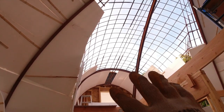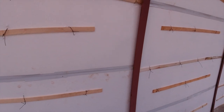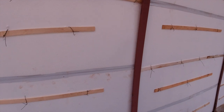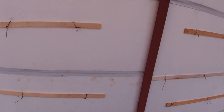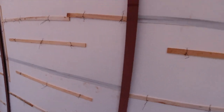And tomorrow's big goal is that whole section right there. When he pushes, it pushes in. And when we have the shotcrete sprayed from the outside with a lot of force and pressure, that's not good. So we are putting in extra lath tied with rebar wire and spacers anywhere that we think it might need it.